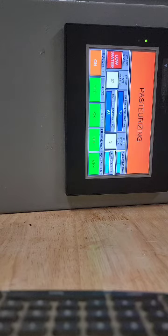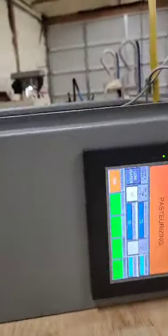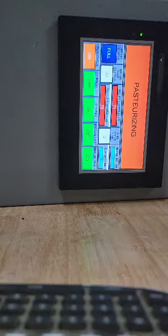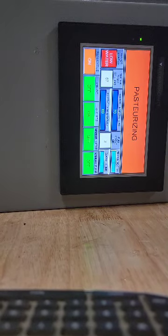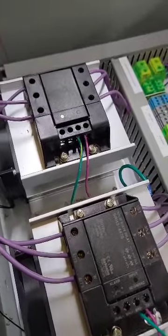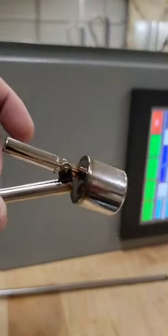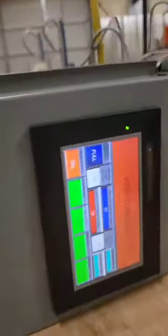Also, low water — if it's low water, heaters are going to kick off. It says low water, everything's blue — because of low water. If it's full, it's red. Now if it cools down and low water comes on, you can see it's heating right now, but if low water goes on the heaters do shut off as well. But now I've got water — if I turn that to high, heaters kick back on because it's calling for heat.